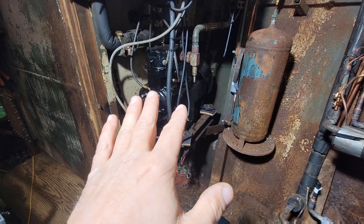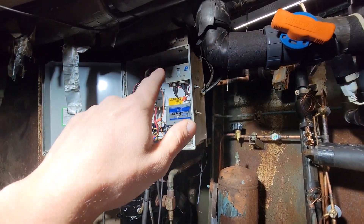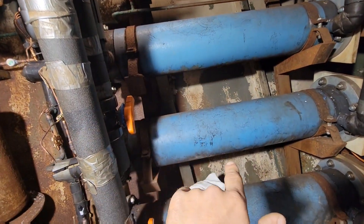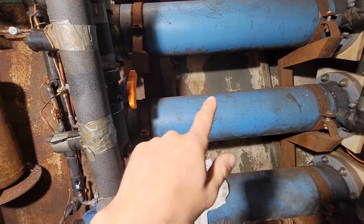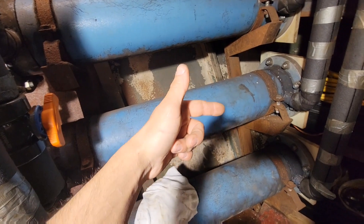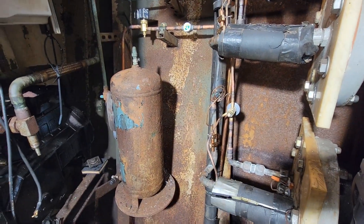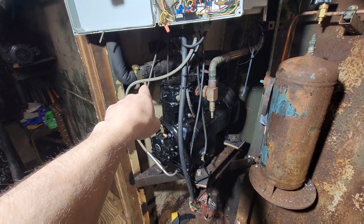They're trying to get to 38 degree water. I'm probably going to convince them to run a little lower head pressure — see if they can maintain around 200. These are five ton barrels. With chiller barrels you can be oversized by a bit but not undersized. It's just a titanium helical coil inside. Maybe I'll close these expansion valves a quarter turn — maybe not. We'll see how it runs. I just want a minimum of 20 degree superheat at the compressor.